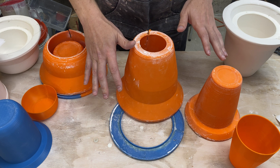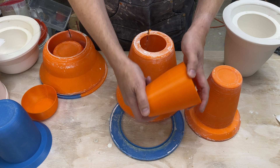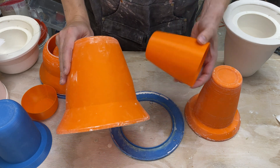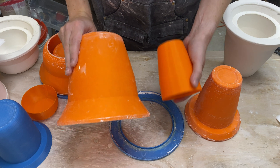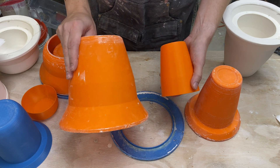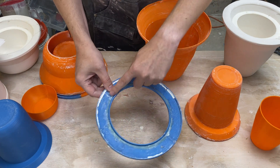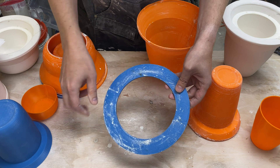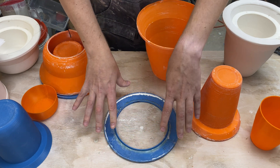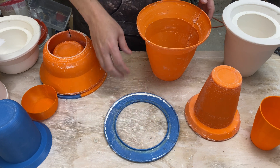First, we're running up against the size of my 3D printer's build volume. To create a cup that's this big, the outer plaster mold needs to be this big — we actually grow a lot. This is the clay shrinkage plus the space needed for the plaster, which is why it gets so big so fast. In my last video you'll notice I printed these rings that wind up sealing it in two pieces and glued them together, because it wasn't fitting on my print bed.